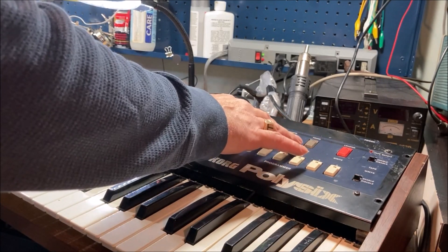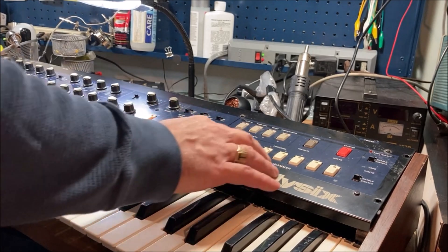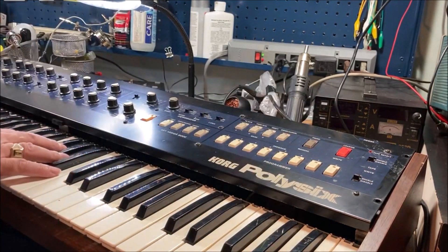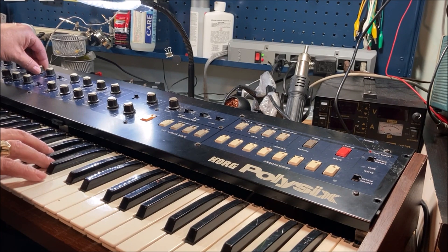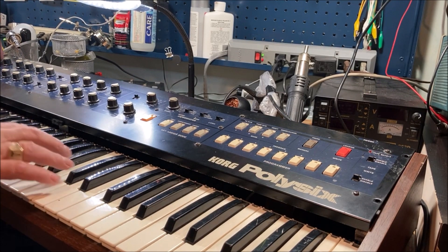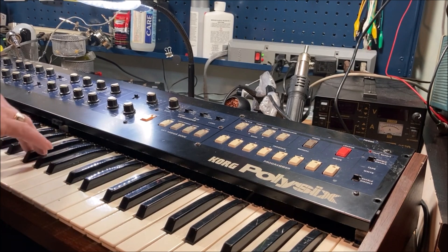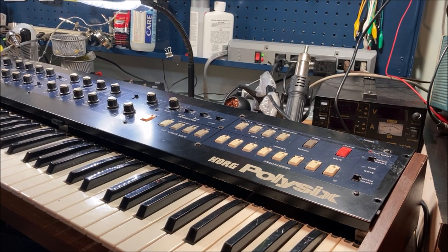What else is going wrong? Well, we've got an error message here, not quite sure what that means. And we have a program light stuck on — I'm going to guess that that's just a bad transistor, but we'll take a look at that. We also had a dirty volume pot, which I fixed. So my guess is we'll load the factory presets, and we'll probably have to take the keyboard bit off and see what we can do about those contacts. I'll take a look at the schematic for that LED. Anyhow, we'll find out.